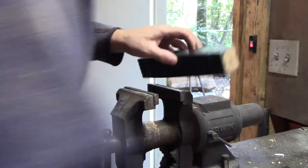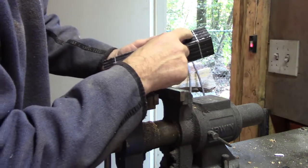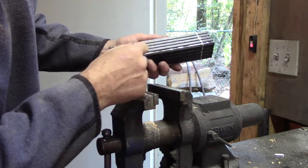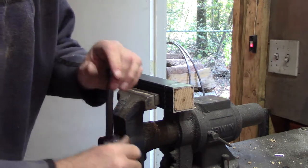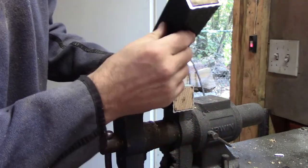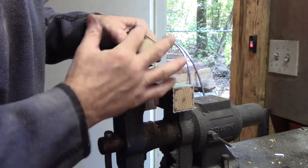With a drill press I could just send it straight down through. I took this plate, marked the center, center-punched it on one side, but you can't replicate that perfectly from the other side, so I have to use the centerline method - drill a little bit from each side with a pilot hole, see if I come out okay, then drill the half-inch hole. These drill presses are cheap nowadays - maybe $100 for a little tabletop version. This oak-in-aluminum spacer came out really good - solid inch-and-a-half material. That's a perfect solution.